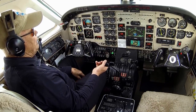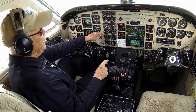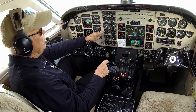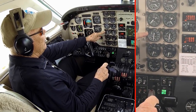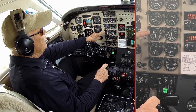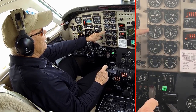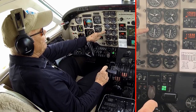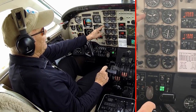So, up on the left side, I'm coming back. RPM is going up even though I'm not adding any fuel flow or power to the engine, just because the blade is getting flatter. So what I'm going to look for now is where does the peak RPM occur before it starts falling, indicating that we've now left the beta range going reverse. As you can see, it's still coming up. And there it starts going down.